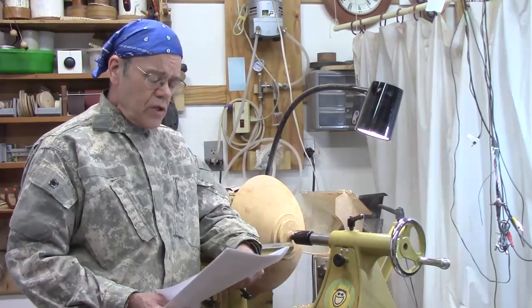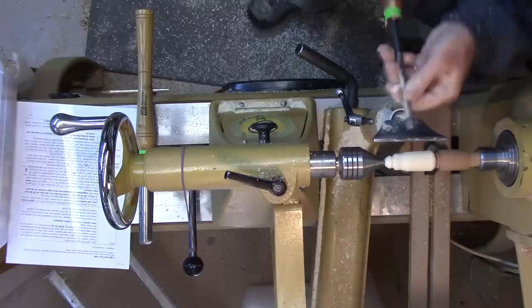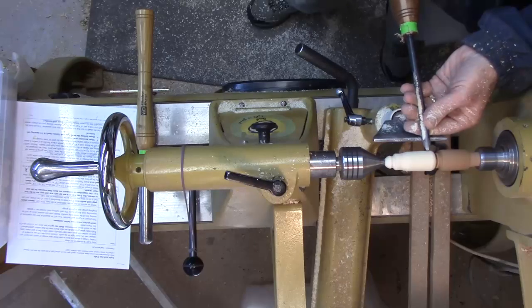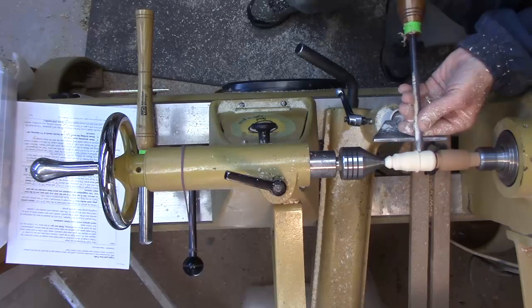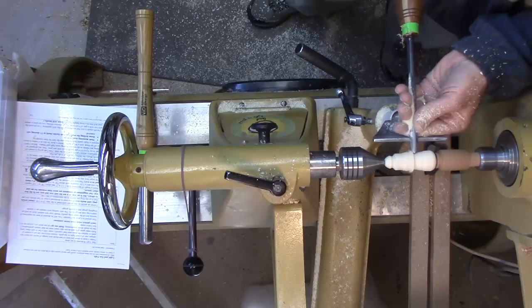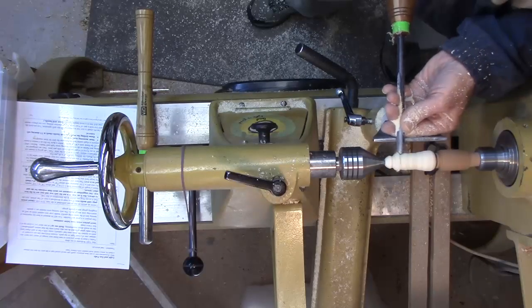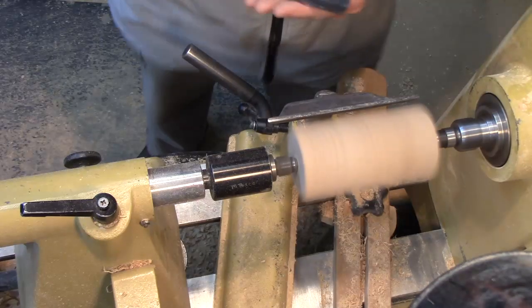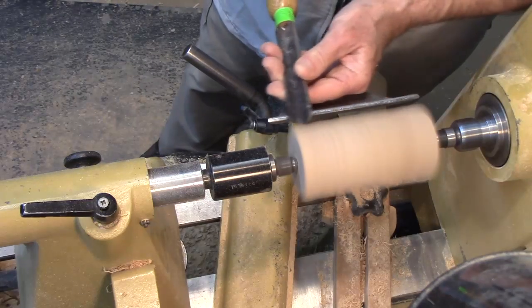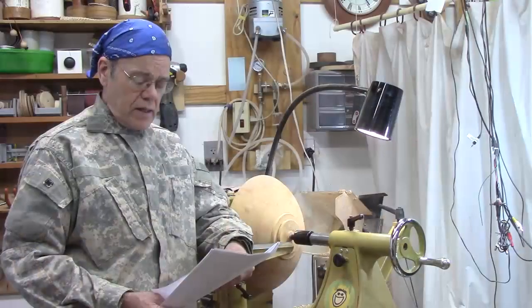You turn faster when doing small spindle work, including pin turning. We're going to speed this up a bit — this is just normal spindle work. You can usually go faster when doing finishing cuts on smaller items that are well balanced. Going faster is certainly safer when you've got tailstock support.